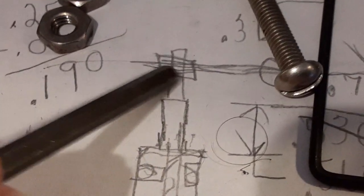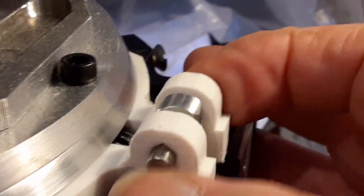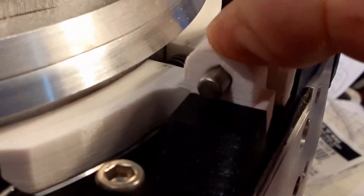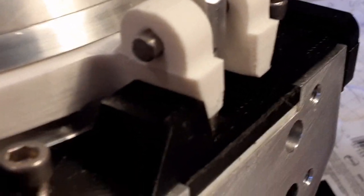This is the piston here, and this is the rod coming up with a pin going through there. Right now I just have a little dowel pin going through there - I've got to capture that. I was going to use this bolt, but the head of the bolt is hitting on this piece here - you can see it almost touches it and the head was too big a diameter for that. So I might just put a piece through there, drill a couple holes in the end, and put a little roll pin or cotter pin through there. But that's later on.